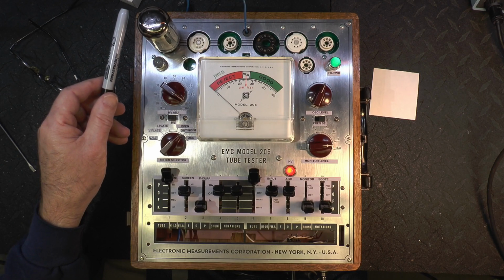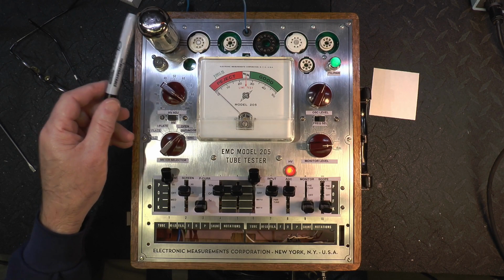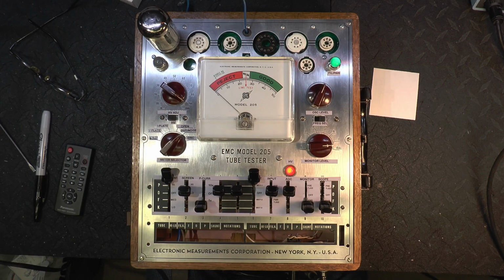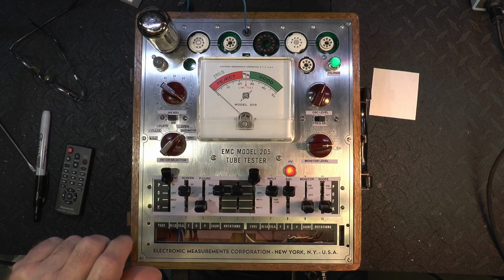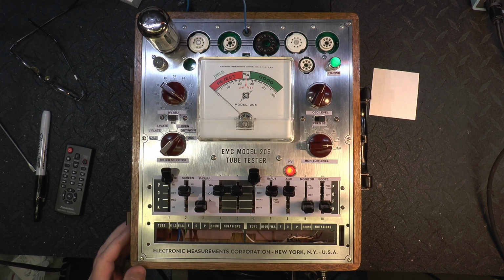But if you do hit a frequency that's equal to that, you'll hear it. You'll hear it through the speakers as feedback. And that's true with any tube, if you get near its resonant frequency. And the microphonic 12AX7s, like say in the front end of a Fender or whatever, will give you some major feedback sometimes. And some people like it.